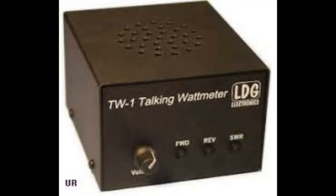Now I'm going to up my power all the way to full power and check it again. The forward power is 113 watts — that's exactly right for this rig. And for the reflected power — the middle button — the reflected power is 0.0 watts. If you were tuning an amplifier, it would be just the opposite: you would want the highest pitch beep when tuning an amplifier, instead of the lowest beep.